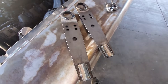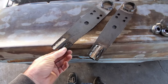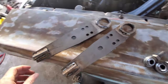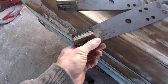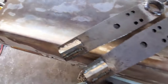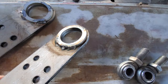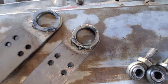Saturday I went ahead and welded the coupler nuts - attempting to submit my own scary suspension post on a Facebook group. Some of my welds look like dog shit but it's been a while. I welded all four sides; that side looks a lot better. This is flux core which is why it's got all the splatter, but it penetrated pretty well. I was still able to run the heim joints up and down the threads - sometimes when you're welding on something with threads it gets messed up and no longer works, but these worked out really well.